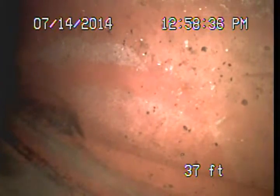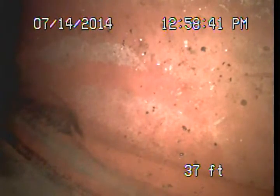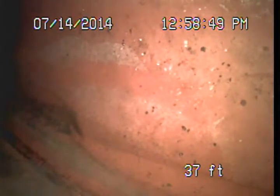Common conditions that will require regular maintenance. Here we're turning into our public sewer here, about 37 feet from where the pipe exits the building. The weak link in this system is that section of original cast iron piping left in service from just under the structure, and then we'll go just outside the front of the building, underneath that tile steps, and at the one landing there. So at some point that cast iron section should get replaced, and they will either put some sort of a clean out in at that point, outside or just under the building.